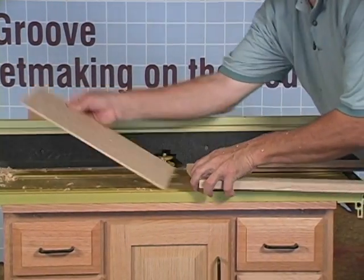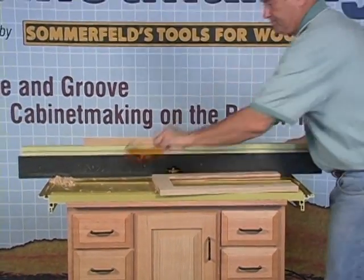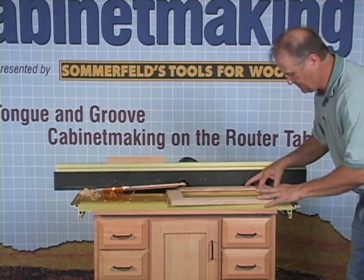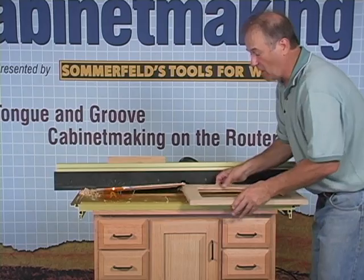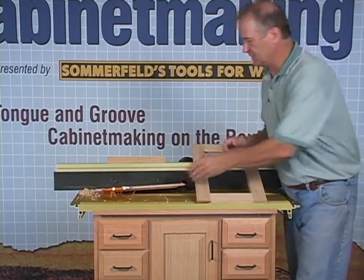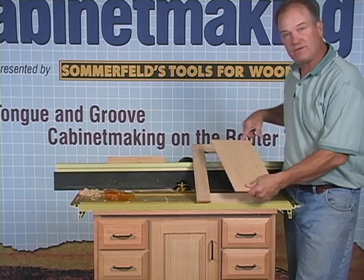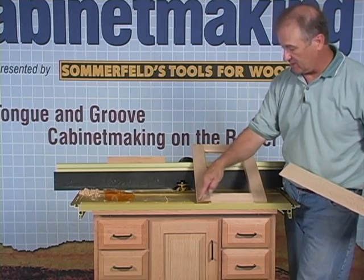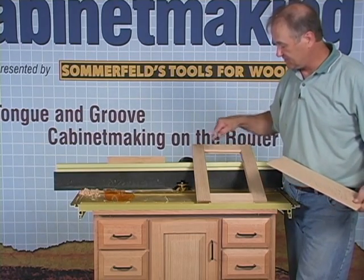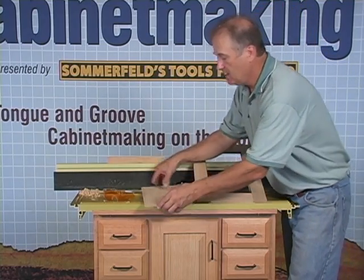Okay, right there is our panel. Now, when we made this panel, we had to make that panel 1/4 of an inch narrower, because we're using hardwood. What's hardwood going to do? It's going to move on you. Wood never dies. It keeps living, expanding, contracting. So when we made this panel, if this rail is 8 inches, we're going to make this 7 3/4. And if our opening right here is 20 inches, our outside is 20, minus that 4, gives us 16. Well, we're going to go 15 3/4. Okay, all that's covered inside in our instructions.